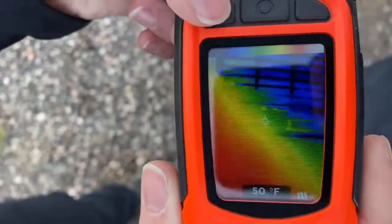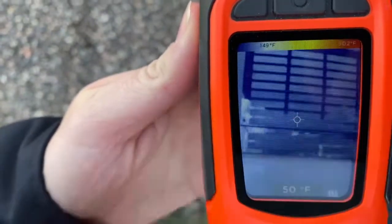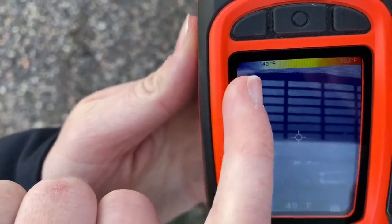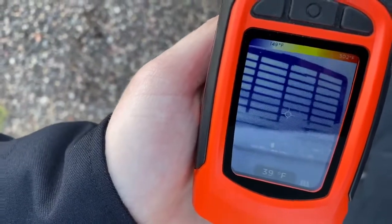Toggling to the next mode, you'll see your survey mode. You can see the specific temperature ranges for survey mode, which ranges from about 149 degrees Fahrenheit to 302 degrees Fahrenheit. This mode would be good for size-ups, low-temperature fires, or just getting a quick reading on something.